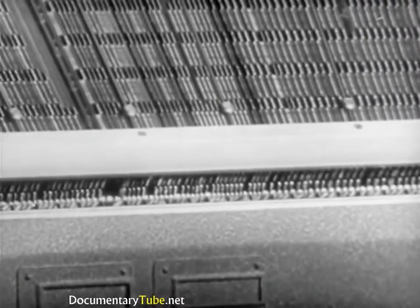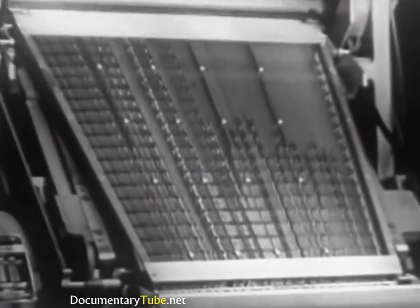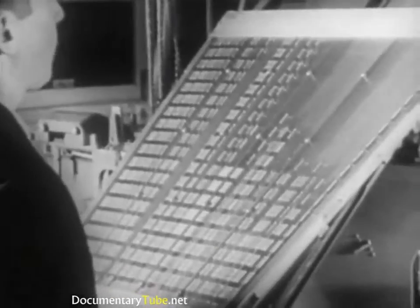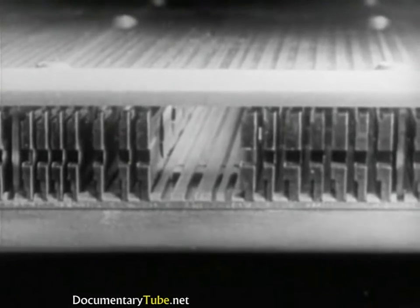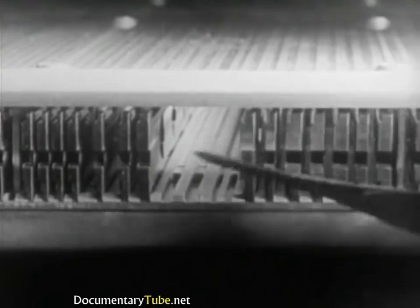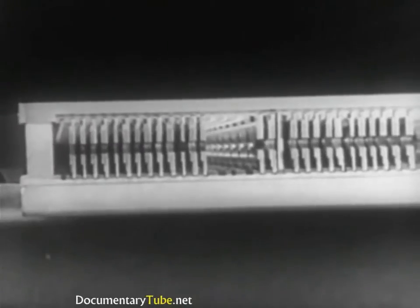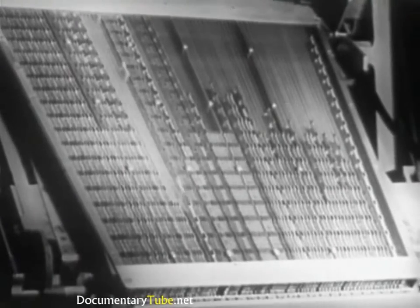The mats come out from the magazine situated at the upper part of the machine, which rests in a slanted position to facilitate the descent of the mat. It is substantially formed by two trapezoidal plates — one below and one above — which can be made of visalite. On the inside of the magazine, there are grooves called channels, which support and guide the circulating matrices. The magazine has 90 channels corresponding to the 90 keys on the keyboard. Every channel contains a maximum of 21 circulating mats, which are sufficient for the normal requirements of composition.